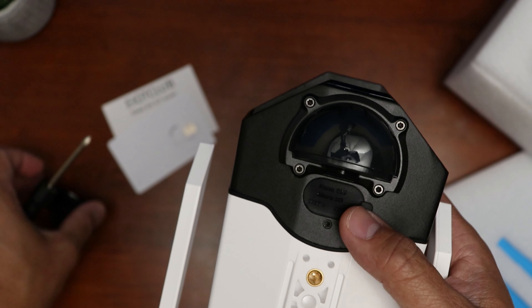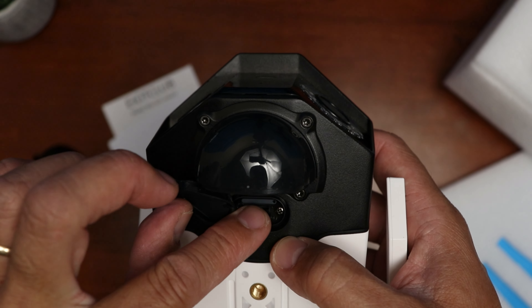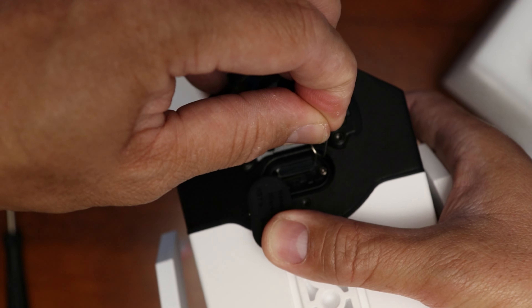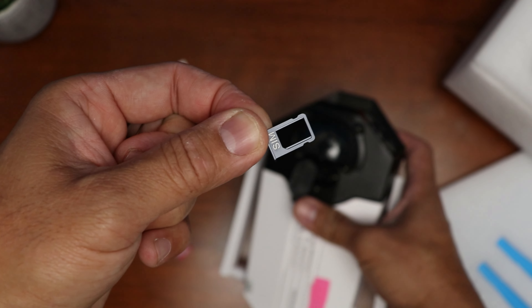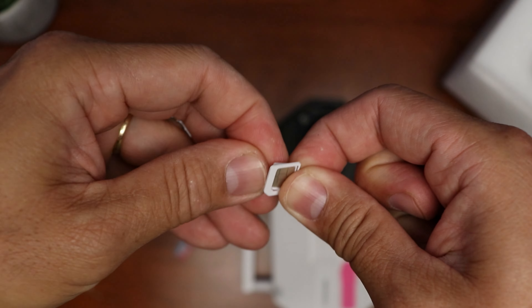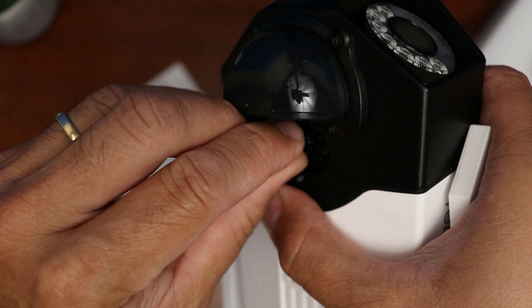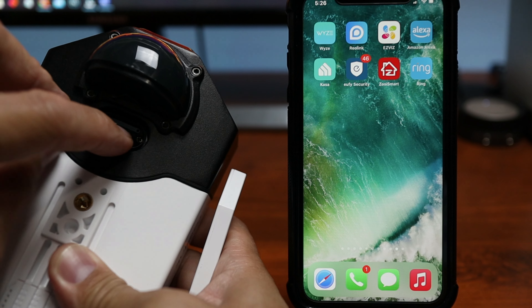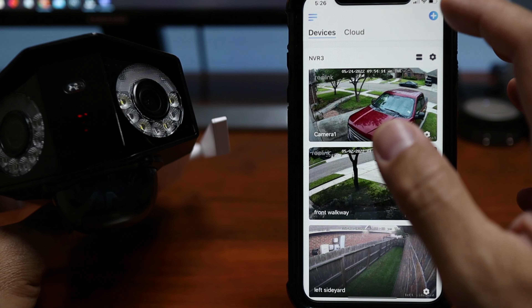There's also a Philips driver and a camera mount with a metal bracket. Unscrew the screw holding the plastic piece behind the PIR sensor, and you'll see a rubber flap covering the on/off switch, SIM card slot, microSD card slot, and reset hole. Using the included pushpin, push it into the SIM card holder hole so it pops up. Take your SIM card, pop it to its smallest size, place it in the holder, and put it back in. Insert your microSD card, charge the camera, and you're ready to set it up.